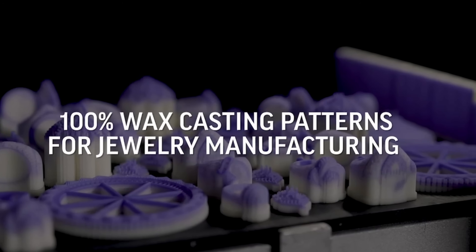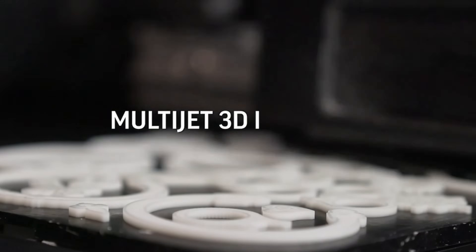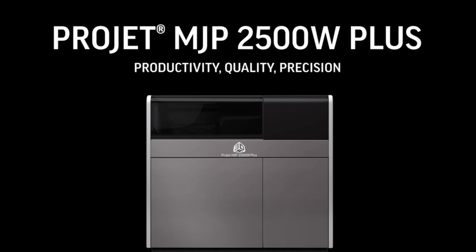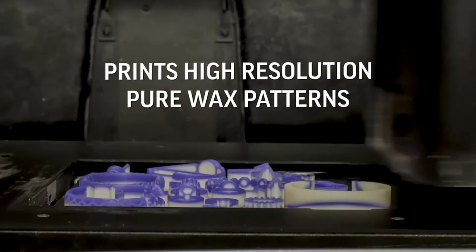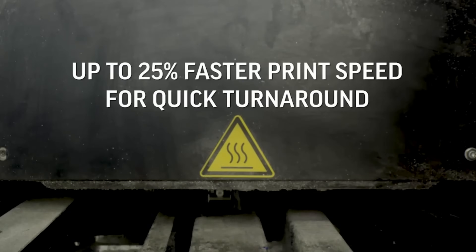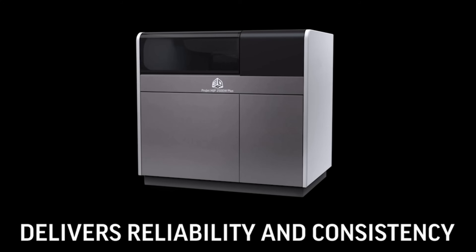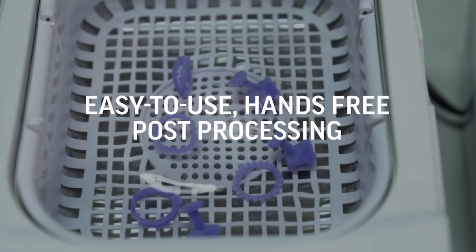What these machines do — the ProJet series — number one, we're using multi-jetting technology. We're spitting material onto a plate up to a resolution of 1200 by 1200 dots per inch at a slice height of as low as eight microns. We're spitting material onto a plate and encasing the parts with a dissolvable support wax. That wax removes really easily — we put it in an oil bath at a different temperature, the support wax melts at a lower temperature, we remove the printed part quite easily and you're ready to go with casting.